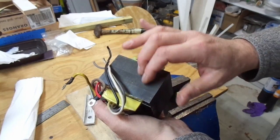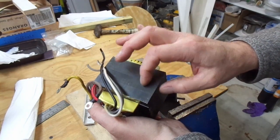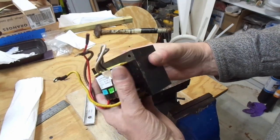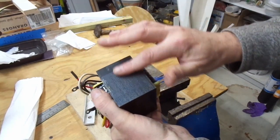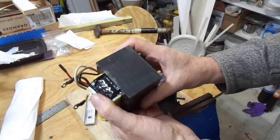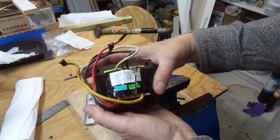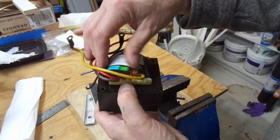It's a bunch of layers, and when you're trying to cut them they can come apart and bind with the saw, so you have to be mindful of that. The reason they're laminated is to cut down on eddy currents that can form within the iron, for those of you that want to study transformer design.